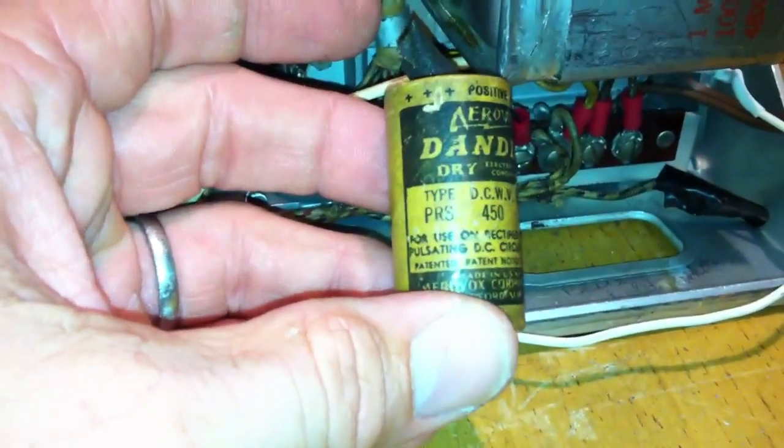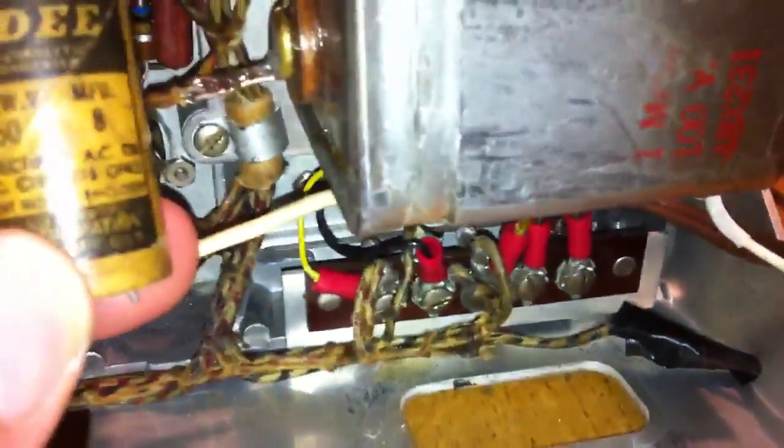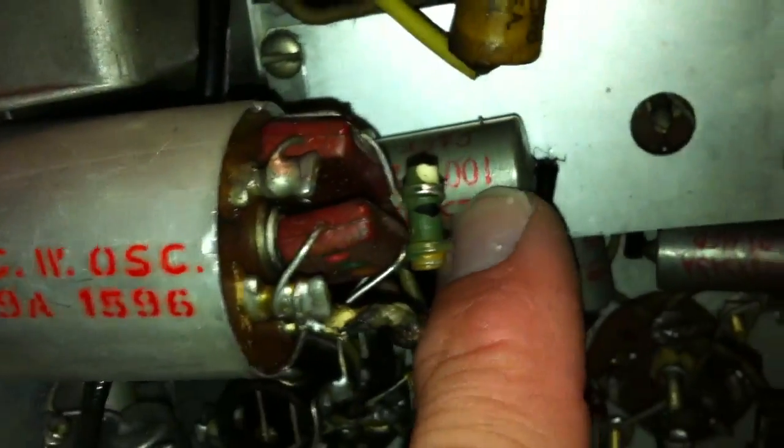Here's a look at one of the capacitors that was originally on the power supply — a paper cap. This is an 8 microfarad, 450 volt, and it was hanging out in this area here, along with another one that was an 18 microfarad. I replaced both of those with modern tubular caps that are now up under this large oil-filled capacitor here. Like I said, cleaned up the wiring and it plays real well. I see there's at least one more paper capacitor here — I'll probably test and repair that. And then there are a lot of these metal can capacitors, 0.01s. There are quite a few of them in here. Maybe I'll get in and test those and see if they're leaking or not.